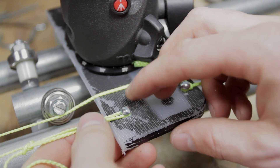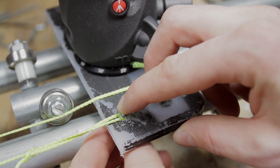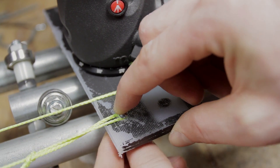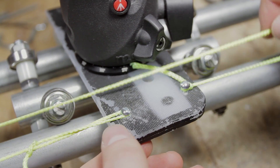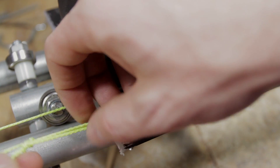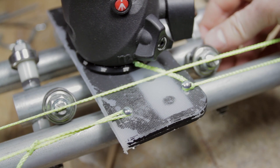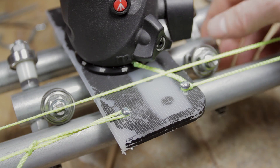You want the tension to be strong enough that it won't slip on the servo when it's turning. You can tighten it by clamping down the bolt — it's a very small bolt — and screwing it in so it's not going to slip anywhere and is pretty snug. That's the actual cart mounted, and now I can show you a few shots of how it actually moves along the track.